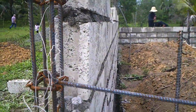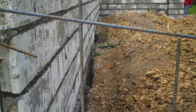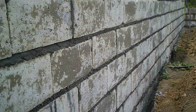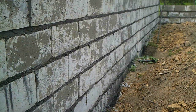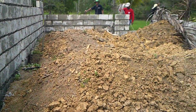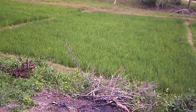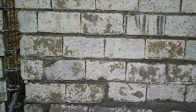As you look down the wall here, they've done a really excellent job. You can see how they cement the horizontal surface — they actually lay the bricks next to each other and then fill everything with cement and work it up, so you wind up basically with a solid four-foot concrete wall.